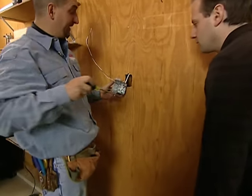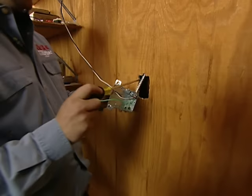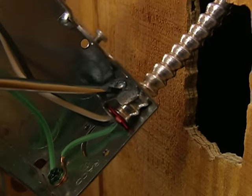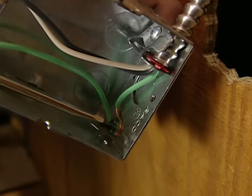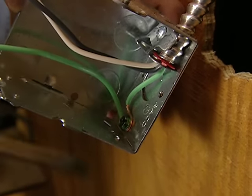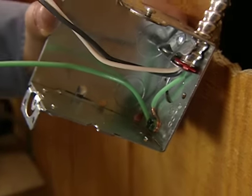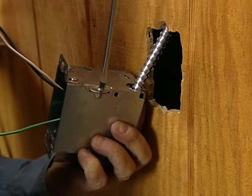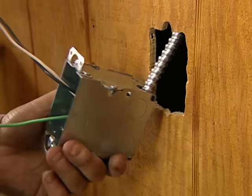What we've done now is we've pulled this MC cable down the cavity of the wall. I've attached that MC cable to this box with this clamp and tightened it down. Then I installed the green grounding conductor to the box with the green ground screw. I'm going to put the side plate back on and then we'll be ready to put it back in the cavity of the wall and attach it to the paneling.